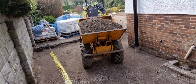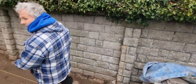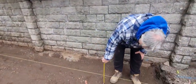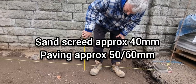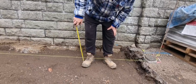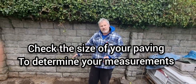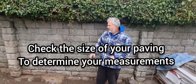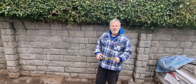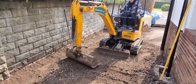We're going to get the second load in now. They've done the first one — the 100mm — and now we're doing the second one. We've got this line back up now. What we want to do is get 90mm below the line, so that's where we need to bring the base up to. There's still a fair bit to go in up there, but we are doing it in layers. We'll get on to the second stage, and once that's in we're going to whack it and then the base will be in — ready for rock and roll.